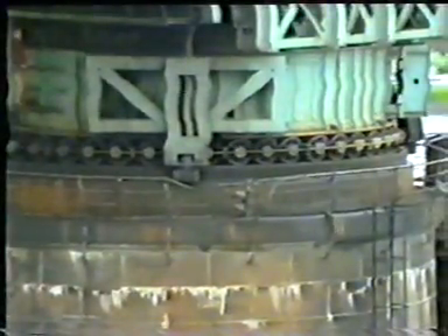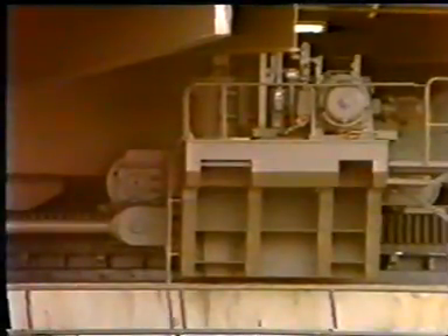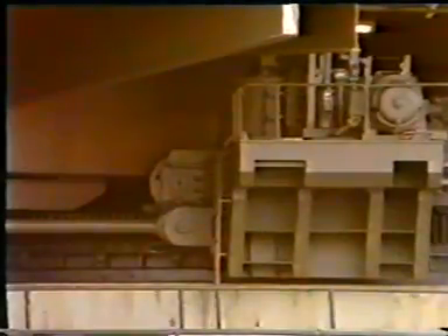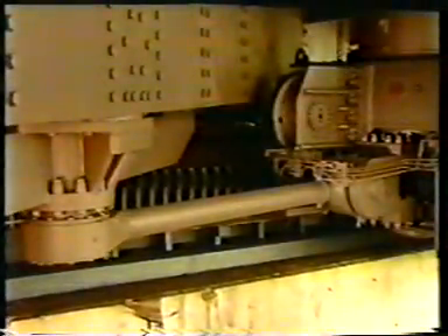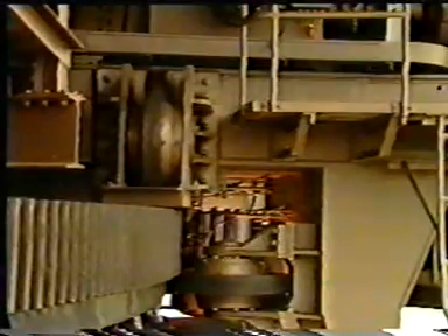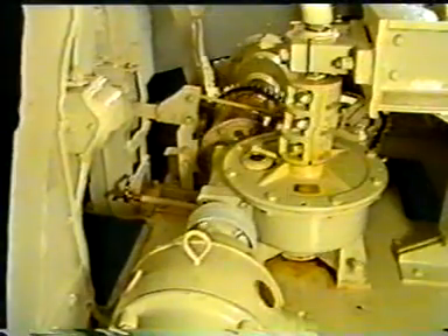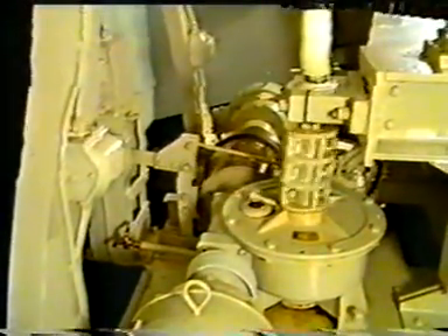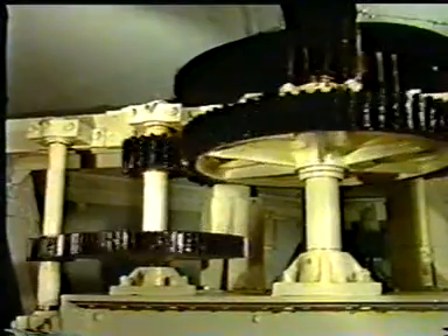The pinion, mounted in a frame fixed to the bridge, reacts against the pier, which in its turn is connected to the ground. In another solution, the drive and the pinion are combined in a so-called locomotive. It drives along a toothed rack on the pier and moves the bridge by means of a pull-push rod. Another example is an open gearbox: a crank and a pull-push rod are driven. In fact, this is an alternative for the Panama wheel. In a hydraulic system, the pull-push rod is replaced by the piston rod of the cylinder.